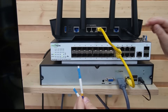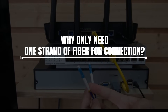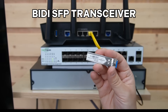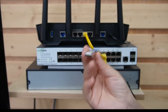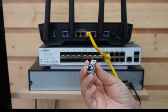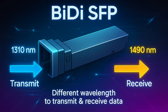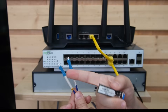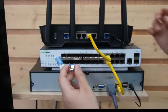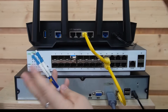Remember we used string C, so we just have to put in string C. You might wonder why we only need one string of fiber optic cable, not two — because we are using a BD-SFP transceiver. BD stands for bi-directional, and it uses WDM, Wavelength Division Multiplexing, to transmit and receive data over a single fiber string using two different light wavelengths. So it halves our fiber usage — we only need one string for full communication. Super efficient.